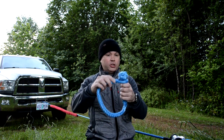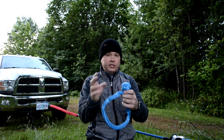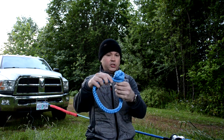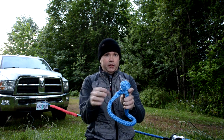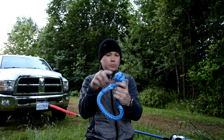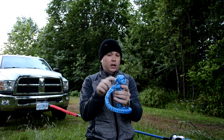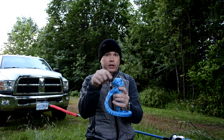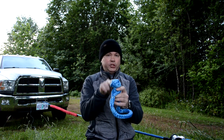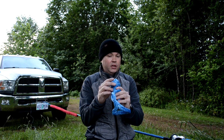It's time to use mechanical advantage to finish tightening the button knot. I'm going to tension the winch with the soft shackle in one position, tighten and relax three times, then flip the shackle so the noose is on the opposite side and repeat. Then I'll turn the knot 90 degrees and repeat, and again 180 degrees. Essentially all four sides of the knot will have been tensioned, equalizing the tension all around.